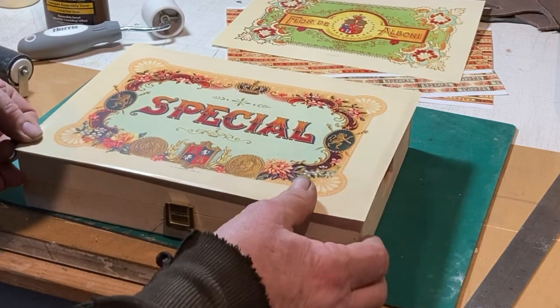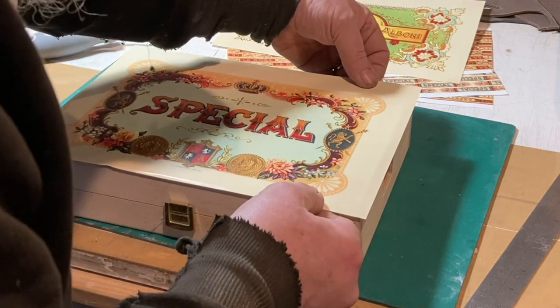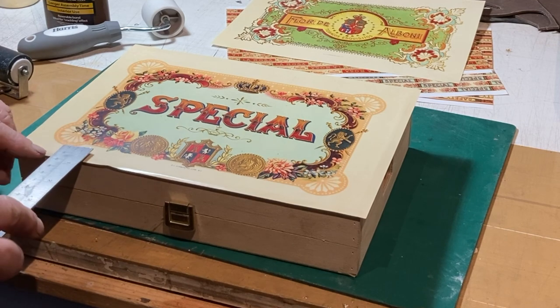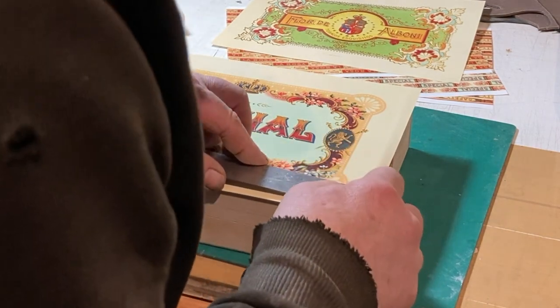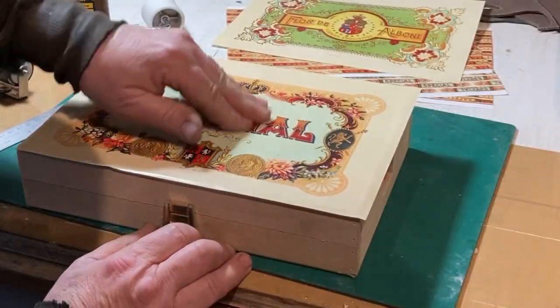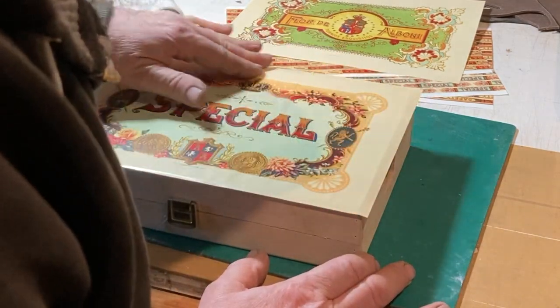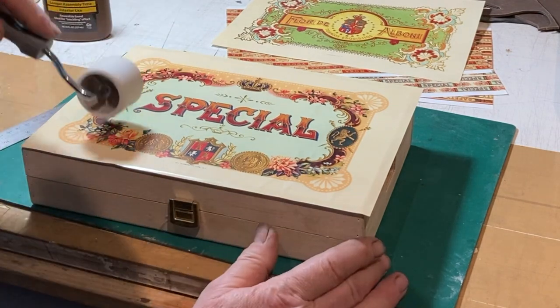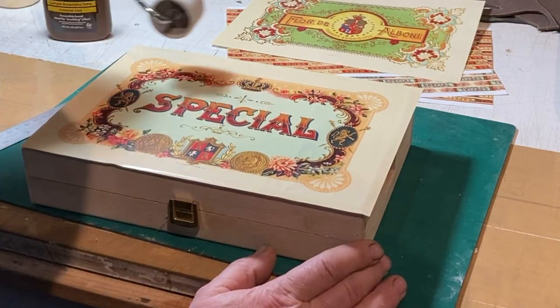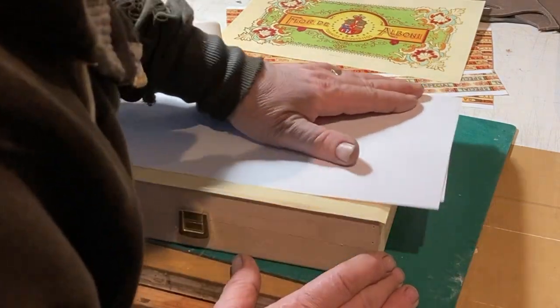Okay, so we've done that. You just pop it on there — there's enough leeway to shuffle it a tiny bit. You can double-check your measurements while it's on there: 14 mil there, about 16, about 16-17 — that's okay. I'm just going to smooth it out with my fingers. Make sure your fingers haven't got any glue. A clean damp cloth is a good idea. This glue is more prone to wrinkling because it tends to wet the paper a bit.